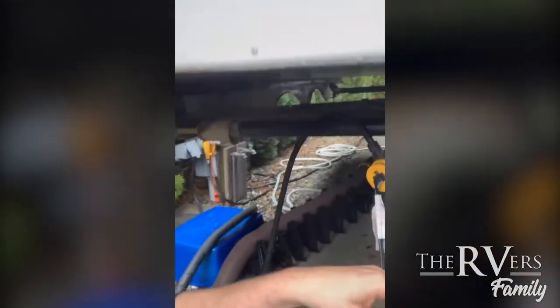Here's our secret weapon — this cable that we were able to jam through the slide over here, because our post runs 30 amp as well as 15. Inside, we've got a magical thing called a space heater. The cool thing is instead of running that off our trailer power, we can run it directly off the post by sticking that cable through the slide. So now we still have 30 amps for the trailer and power to run a space heater.